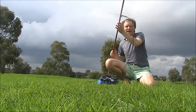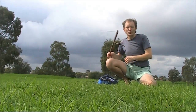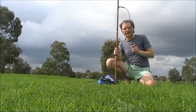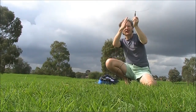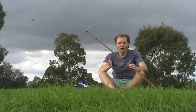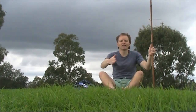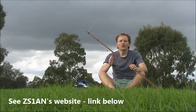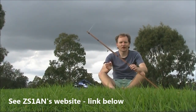When you look at the antenna this way, it looks a bit like a very wide spaced Yagi that's been cut in half straight down the boom, but the behaviour is very different. When you aim it like this, and the beacon is in that direction, the signal level is very low. But like this, it's nice and strong. Back on the dipole, the signal is significantly weaker. A bobtail antenna like this is super simple to build, yet provides worthwhile bi-directional gain on VHF. It's suitable for SSB work, horizontally polarised, if it's erected like this, or for FM and repeaters like this, where it will give a vertically polarised signal. There's a useful design on ZS1AN's website where construction information is provided for a bobtail antenna on two metres.